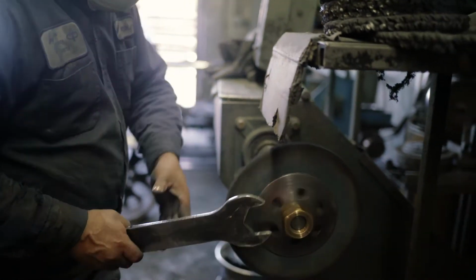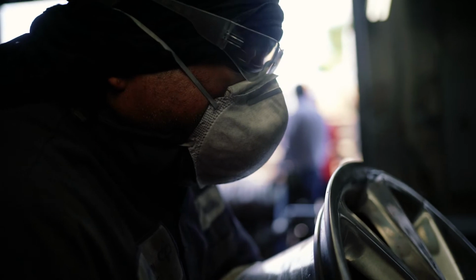So use a sanding disc of about 600 grit that clears up all the clear coating that's on there, any imperfection that's ready for Tripoli polishing, the coarse cut polishing as we call it. And then now you'll go to getting out the windows with the stand-up lathes, which we'll see in a minute.